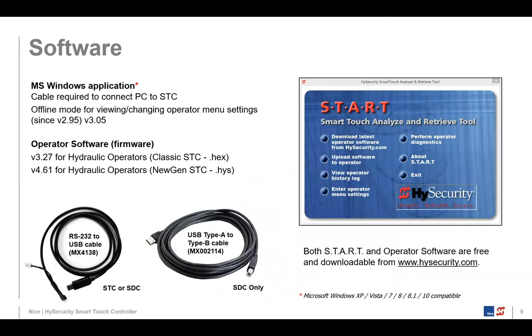We've talked about the hardware behind all those interfaces — the fire department open, sensor one, sensor two — but there's also software that corresponds to each hardware interface. That software is accessed through the keypad display. There's a two-level menu system: the user menu and the installer menu. Once you hook up a hardware device or connection, you go into the installer menu and define what that interface is set up for. The Smart Touch Controller board is microprocessor-based, not PLC-based, and the thing that makes all the settings work is the firmware on the board.